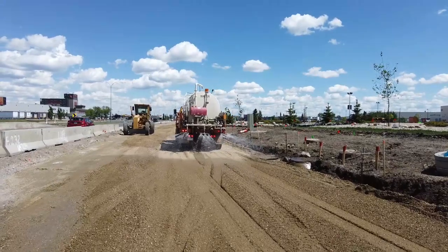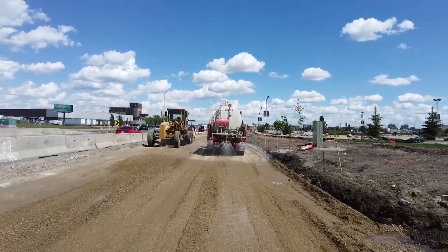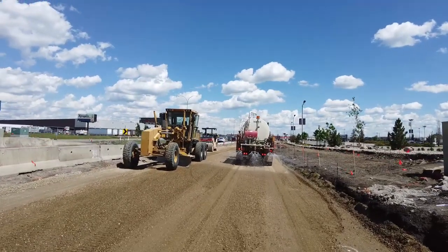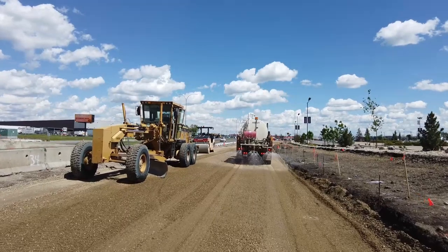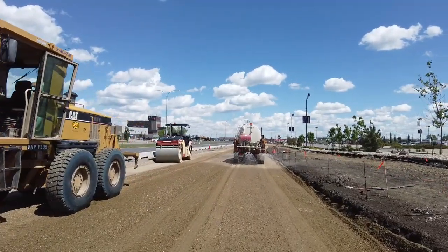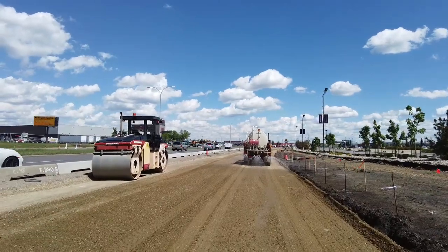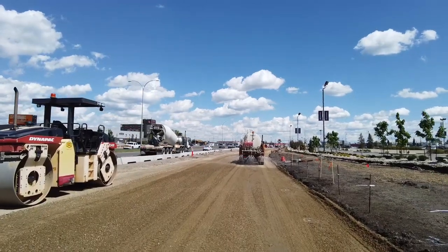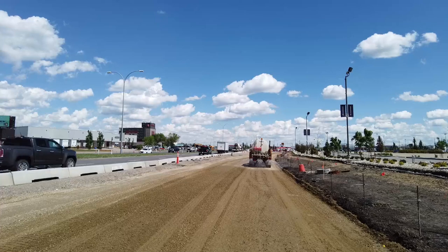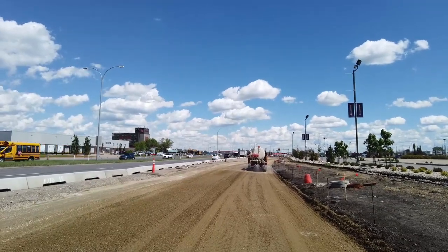Here's the end result. We're giving it a shot of water now and we'll pack it. The real point I wanted to get across is that the area where the curb is going to go, you want it to be more or less level. Sometimes it actually looks a little crazy in the end because you kind of have a bench. If there's curb on the top side and you're doing the same thing on a crossfall, it looks a little wonky again — maybe someday I'll do a video on that, and your bench would be in the other direction. Thanks to Trevor and Adam for doing grades for me, and thank you for watching. I hope you found that interesting. We'll see you next time.